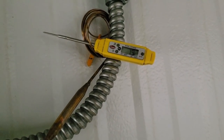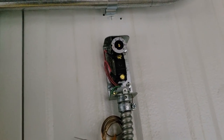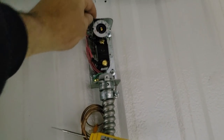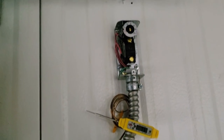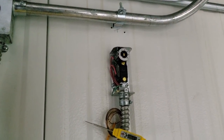It's probably 20-some feet up here in the air. The coil looks pretty good. We waited for a little while — 7 degrees. And as far as getting it to come on, I had to go to negative 5. I made sure it isn't pinned in between there, because it's inside the frame and it shouldn't have done that. At this point, I am going to say we need to replace the thermostat.